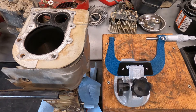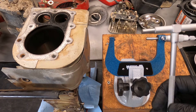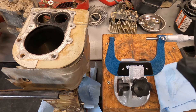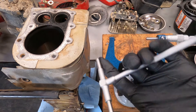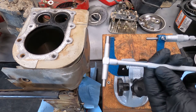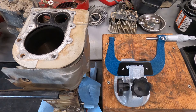Take your telescoping gauge. I have a big set of these - this is a two and seven eighths to three and a quarter inch. If you don't know how these work, they spread out, and then as they go in, you tighten them up at the bottom. Once it goes in, tighten the knob at the bottom and then it stays that way. Let's go right in and do it and start doing some calculating.